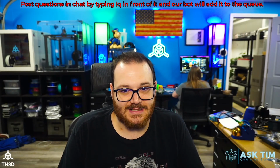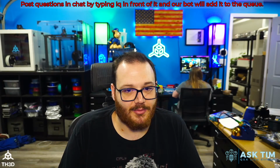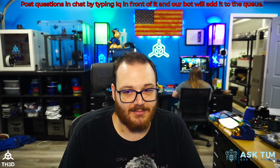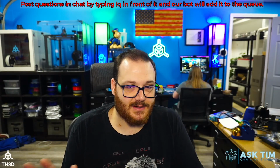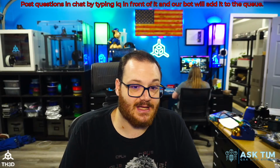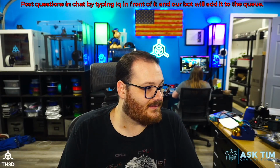Justin DeBell: working with a friend designing speaker pods for his bike, will be printed out of ASA for durability. Should I go with a 0.6 and use 0.3 layer height, or what do you recommend? If it's going to be finished, like you're going to prime it, fill it, and smooth it out, I would do a 0.6 nozzle and a 0.3 layer height, and many outer layers.